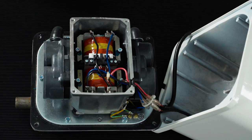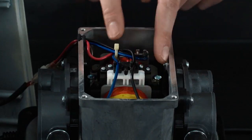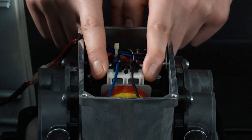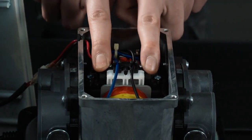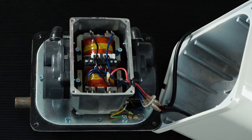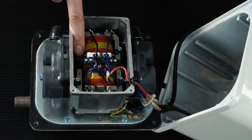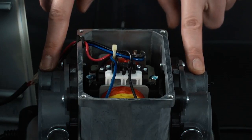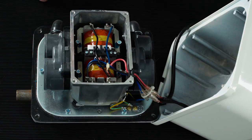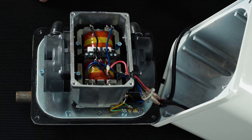Component overview. Before we move forward, it's probably a good idea to pause for a moment and just highlight the various parts which we can now see exposed within the unit. The drive unit sits either side of a magnet, and sitting right above it, an auto stopper switch. The auto stopper switch activates if the pump becomes unbalanced. The most common cause of such an unbalance is if a diaphragm splits or gets exhausted. Each end of the magnet is bolted to the center of a diaphragm, and this diaphragm sits within a valve box. These magnets are really pretty strong, so make sure you don't catch your fingers and avoid wearing watches or getting them close to anything that might be badly affected by a strong magnetic field.